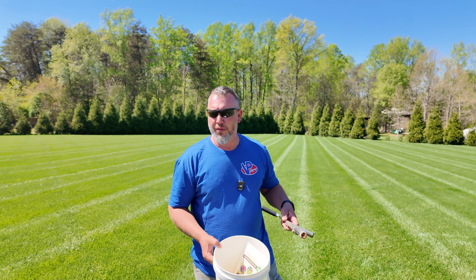The second most important thing: pull your samples at six inches. Most labs will ask for a six-inch soil sample. You can see there's a hose clamp on here marked at six inches — it's been on since 2019. This probe is an AMS American-made probe out of Idaho. It's the 42-inch with the footstep on it and it works absolutely phenomenal.